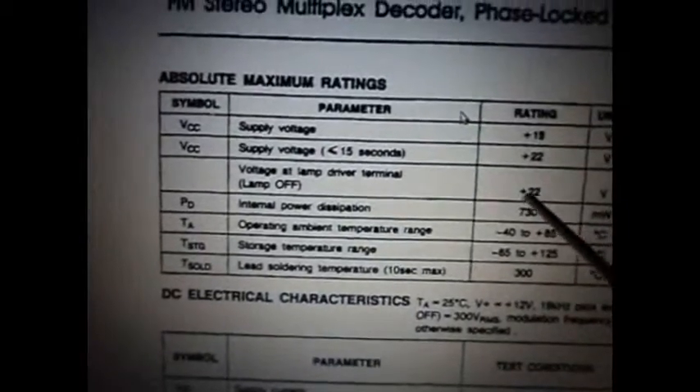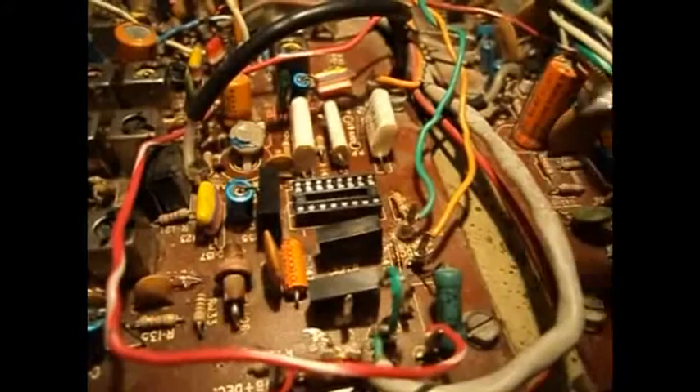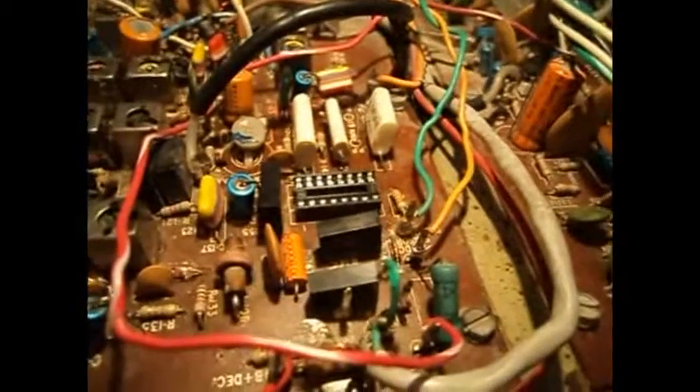I can't imagine that they did this on purpose. The B plus was probably originally a little bit lower, and that's why we're having problems now. The power supply doesn't have any sort of regulation — no resistor doing any voltage drop or anything. It's just straight from the transformer, rectified, and then the individual circuits take care of their own voltages with resistors or zener diodes. There's nothing at the power supply I can do to bring the voltage back down. I think the design was made when line voltage might have been slightly lower, or maybe something's weird with the transformer.